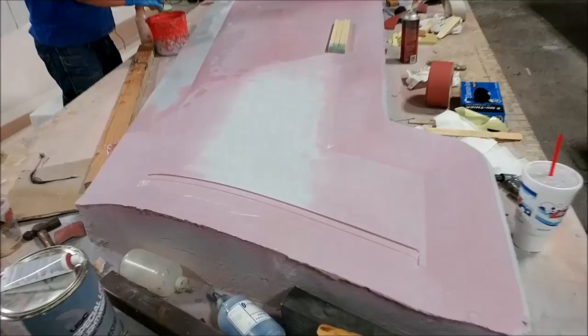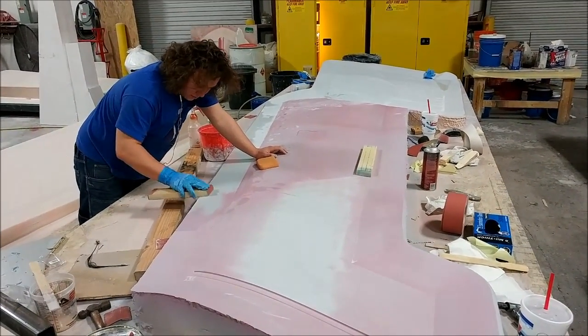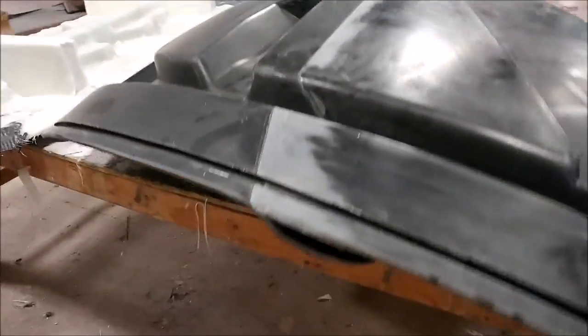There's Devon again — he's made quite a bit of progress and is actually working on the flanges of the outboard part of the wing right now, so this one is probably going to be ready tomorrow for the next coat of primer. Here's the door frame mold — the first one — which has had bracing put on it, bolted together with little pins holding it. That one just needs to be waxed and it's ready to lay up the door frame, which is exciting because once the door frame comes together, we can start bonding the fuselage together.